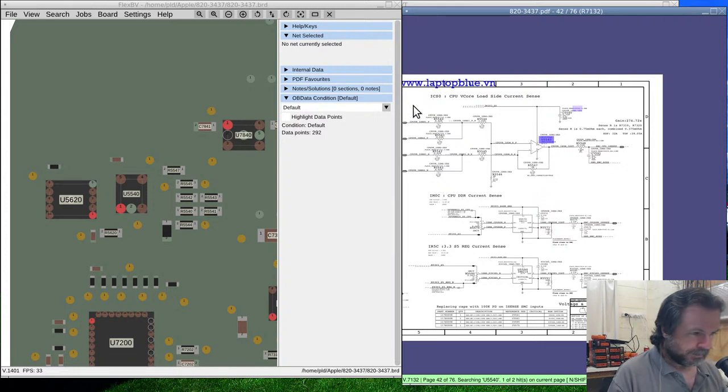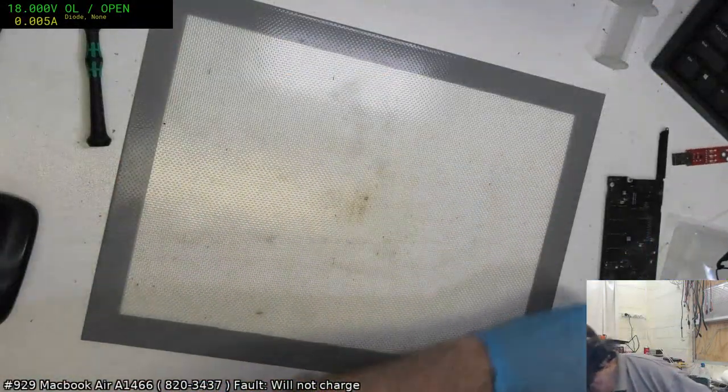All right. Honestly, when you get these scenarios, it's often better to just take off everything that they did and do it again yourself. But that chip looks like it has been replaced. I'm just struggling to think where to start. Okay, first thing I might do is put this board plugged into the screen and see what our resistance or diode mode is on that 3v3 for the display.